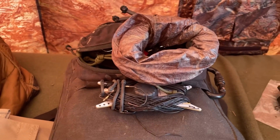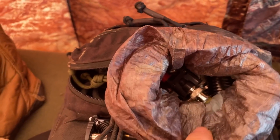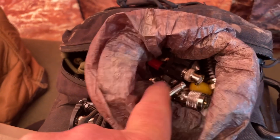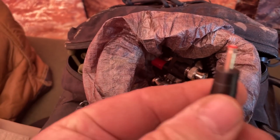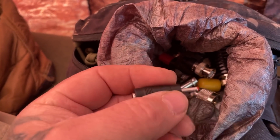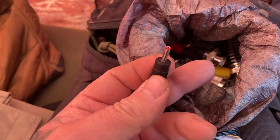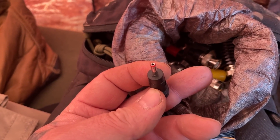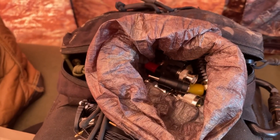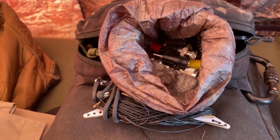One other thing in this radio bag: in my antenna bag I carry a bag with different adapters for the radios, including one small banana plug adapter that reduces the regular 12-volt banana plug used on the radio to fit not only the Baofeng batteries but also the ICOM handheld battery — just in case I need to charge a handheld while running this radio pack.